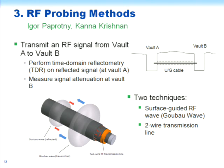So the other RF approach then is to couple to say a pair of these concentric neutrals. Since we're forbidden from drilling holes into the jacket and making galvanic connection, we're looking at a capacitive scheme for exciting a pair of these and exciting wave propagation in there, from which we hope to be able to measure, if there's some damage, we might see reflections, and so forth.